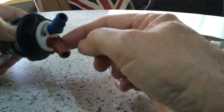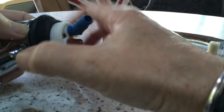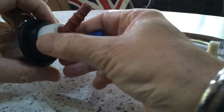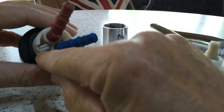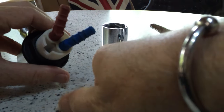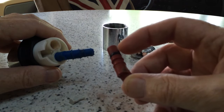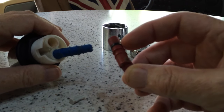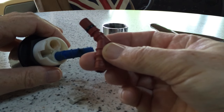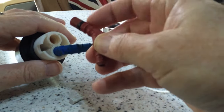If one of those push-fit tails is leaking, they are also replaceable. This is just the nut that holds it under the worktop. With the nut out of the way, you can see there's a pin here — move that pin out and it releases the tails. You can see there's an o-ring on each of them. So if you have a smooth bore tap and want a rough bore, you can change them over — they're interchangeable — or if you've got a leaky o-ring, you can attend to the leak that way, providing you can get to the bottom of the tap without taking it off the worktop.